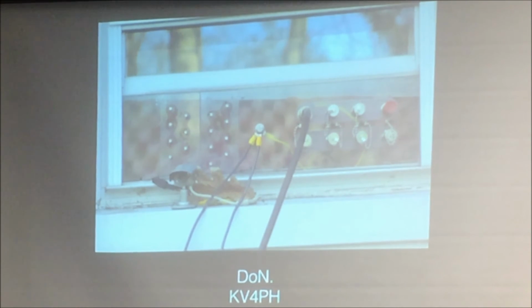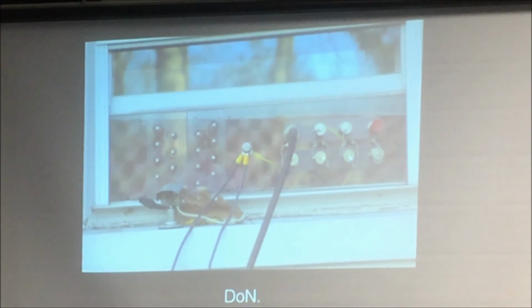So I decided to make my own using a sheet of about 3/8 inch thick Lexan. And it's tucked into the groove. The ends I milled down thin enough so they would fit into the grooves that the storm window slid in. Planning to bow the plastic, get the ends in and let it snap. It was too strong. So you'll see there a whole bunch of little white dots. Those are screws. There's an extra plate of Lexan on the inside, threaded through into tapped holes in the outer plastic, and in this dimension here is the secondary plate in there. So I could get the two ends tucked in and then run all the screws in, and it's good and solid.